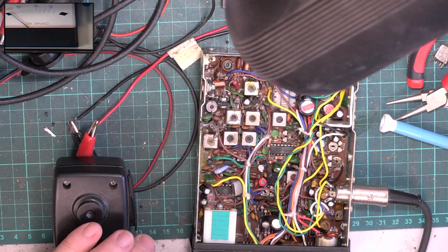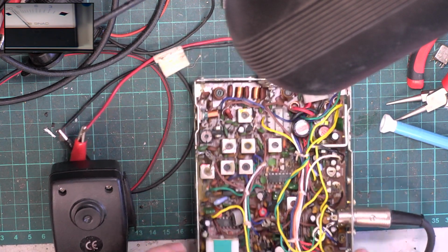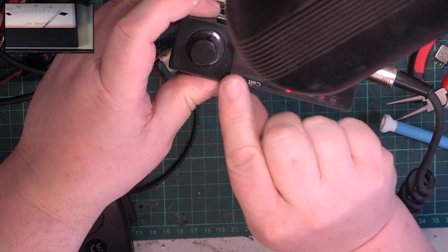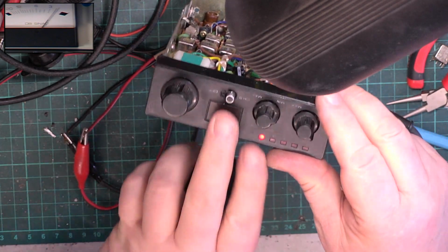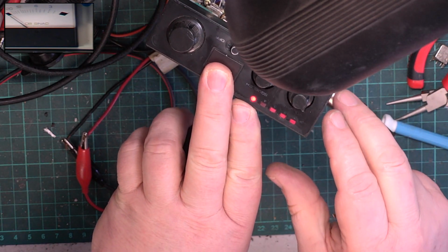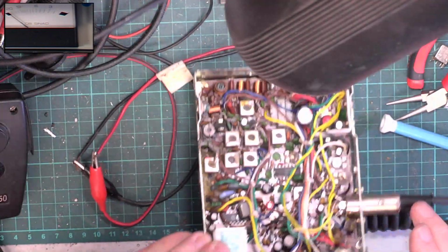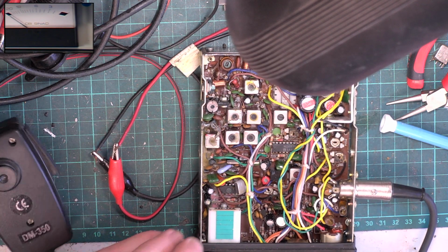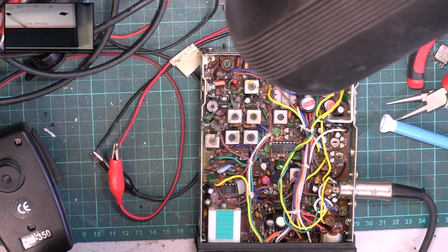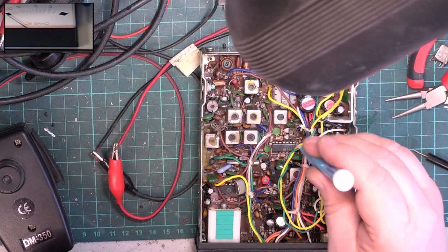Squelch. Oh, channel 9 switch. Takes the display out and puts the light on. I suppose I better check it really is channel 9. Hasn't been turned into... Yeah, 68125, that's fine. So, squelch, turn it to full. 100 microvolts on the radio, and it's going to be the preset there.